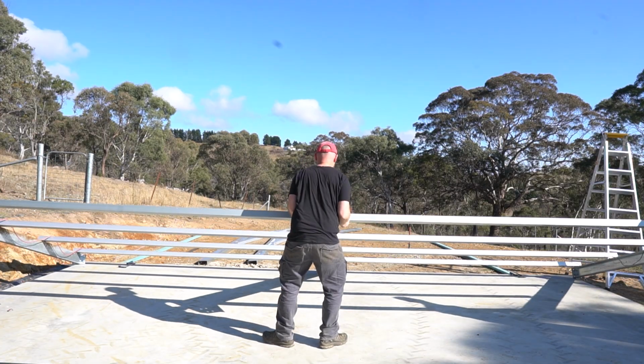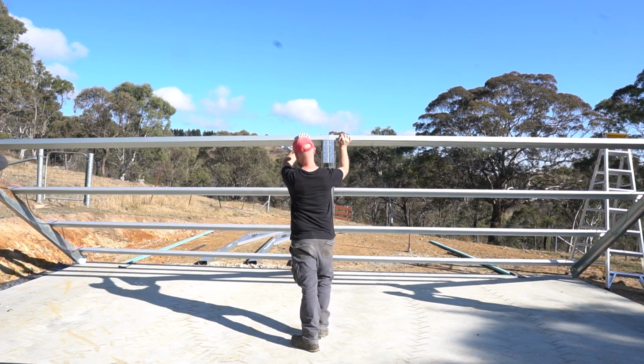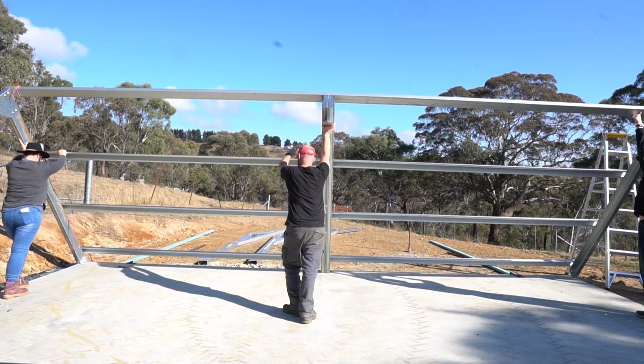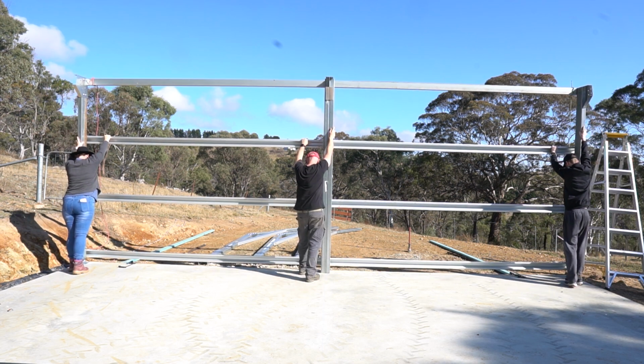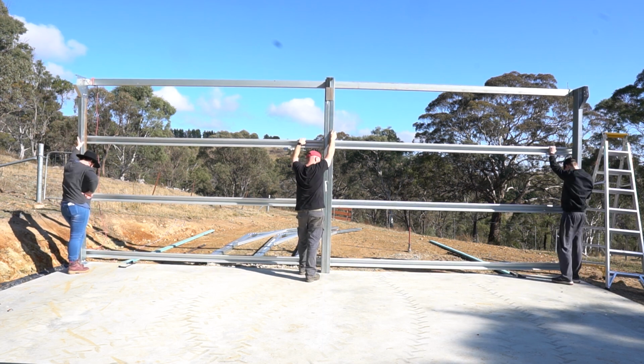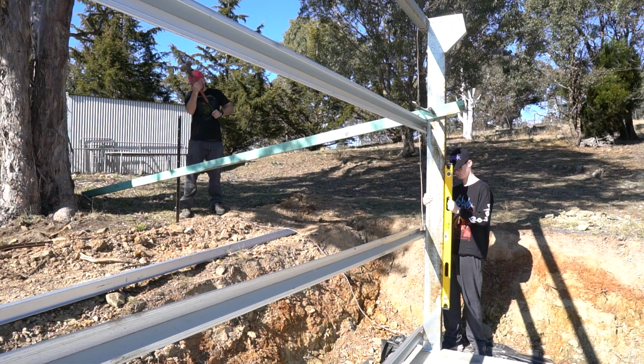For this shed size, lifting the trusses only took a couple of hours. A half-day scissor lift rental would likely be enough, which could save a few dollars. I had a third person help here. From experience, I know these frames are heavier than they appear. My wife and son held the ends while I secured the wall to pickets.